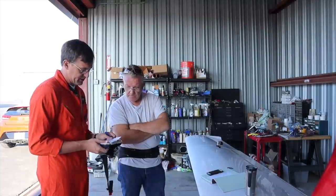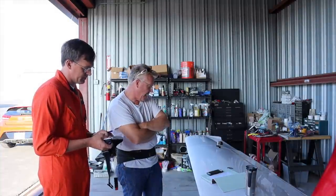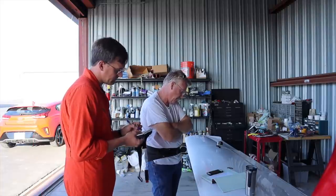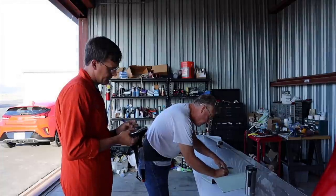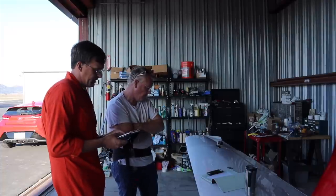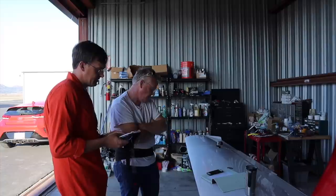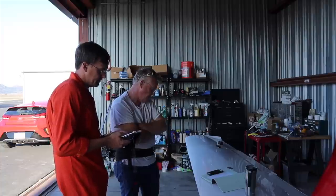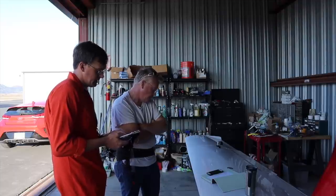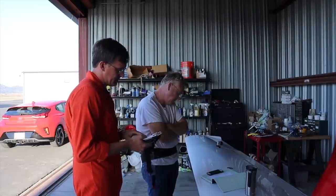Right. So mission limits. Previously established 420 in the climb. Let's set that up so we don't limit ourselves here. Sure. Let's do 440. And for cruise, 420. Okay. Oil temp 215. That still work? Mm-hmm. Okay. Predicted VSO 57 indicated with a 52 calibrated. VS 77 based on the 70 knots predicted clean. Rotation at 83. Flap extension speed 110.